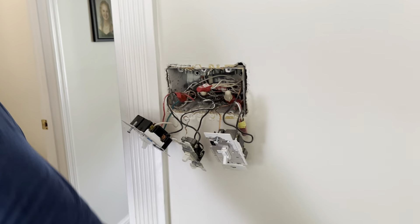I'm just curious if we clamp over there whether we'd show the net current. Because I saw it done in my class — it wouldn't show it if you're just clamping over the neutral; you've got to clamp over the hot and the neutral together. Right now we know these are all branched together and they shouldn't be.